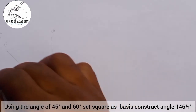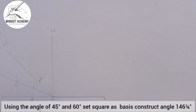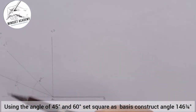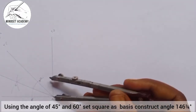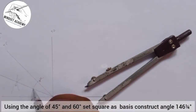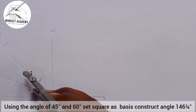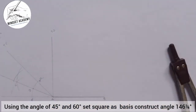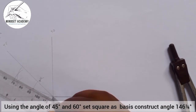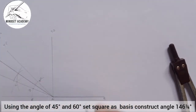When that happens, that angle there will be 22½°. So in between here and the 22½° line, I'm going to bisect again. When I bisect it, I'll take my compass at the point where it cuts and call it point D. Place the compass at point D and strike an arc, then at A-prime-prime strike another arc. Where they meet gives us 11¼°, so I'll draw a line passing through that point.